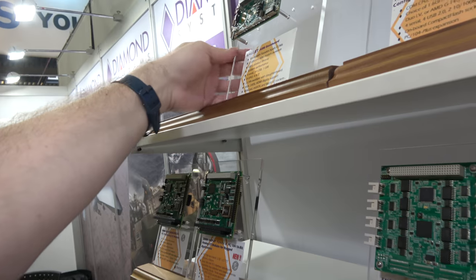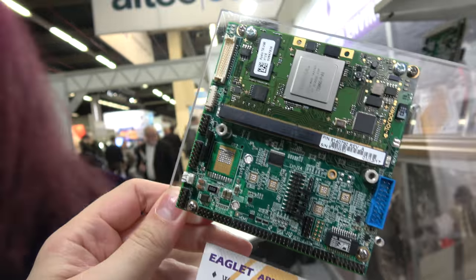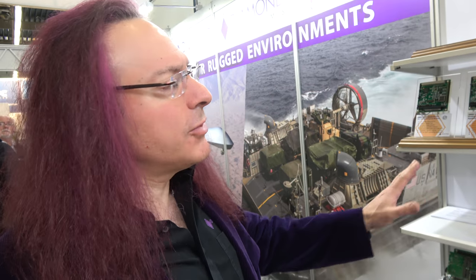Here is another analog I/O board — the same as the previous one but a smaller, low-cost compact version, with one section missing. Pricing is in the $300 range. PCI-104 small form factor customers typically buy in the 10 to 200 unit range annually. If volumes go much higher than a few hundred per year, a customer will typically design their own carrier board and use a COM — the same approach Diamond Systems uses, but done in-house. That's why COMs are so popular: they give people the ability to design a custom product much more easily than before.